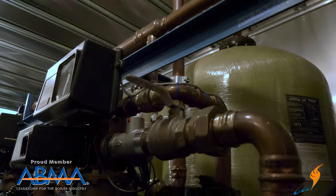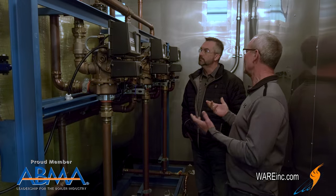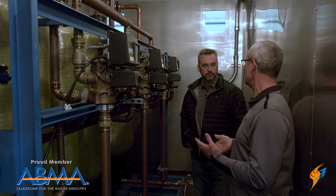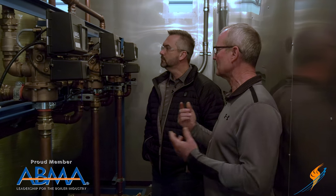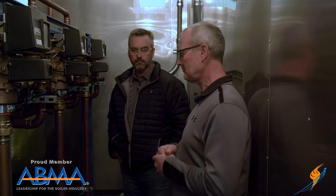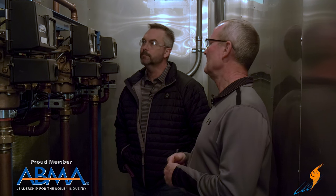Something we've learned over time in the rental business is that all this piping is run in copper. Initially everything came out in galvanized steel, but soft water is really aggressive — it eats steel up big time, and the galvanized pipe didn't hold up. Same with the tanks: they used to be galvanized, but after about five or six years they'd start developing holes in the sides. Now the tanks are fiberglass. That copper pipe is never going to fill up or wear out, and the fiberglass tanks hold up really well unless somebody freezes and busts them — which does happen.